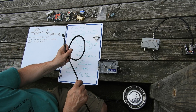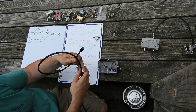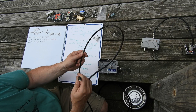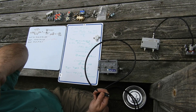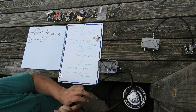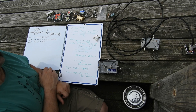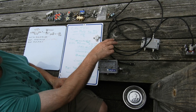There's a minimum radius you're supposed to use when installing cable. That's why you see loops instead of right-angle turns. It's basically like a capacitor — you've got a dielectric, a center conductor, and an outer shield. You have to shield the center conductor to transmit your signal and shield it from outside radio signals. The way they overcome that capacitance is by running at a low impedance — 75 ohms, pretty much universal for distribution.